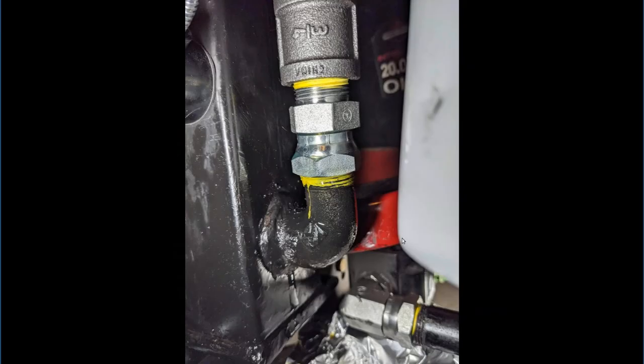Speaking of leaks — here's a great leak. Although the bottom of this tank was welded just fine, when I welded on this three-quarter-inch fitting it wasn't right. It doesn't take much to be off a little bit, and it just leaks and leaks. I sadly tried to glob on more and more weld — that does not work. You need to drain the whole thing, take it all apart. In this case I ended up cutting off the entire fittings, both for the return and the suction side of the tank.